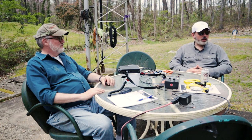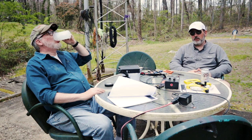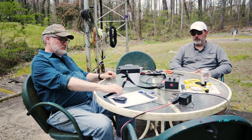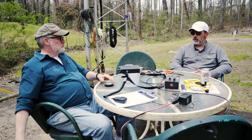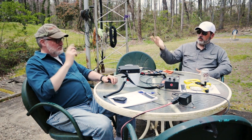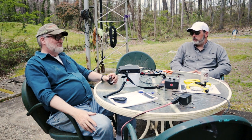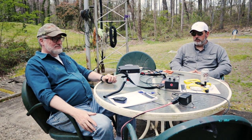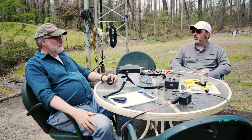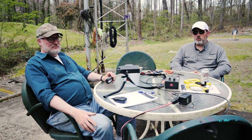And you mentioned Field Day. If you're going out by yourself and there are just a couple of guys, if you're just going to have one station and you're only going to need one antenna, this is an excellent choice for that event. And you might want to consider that. Even if you're doing a bigger thing, you could build multiples of them. Like I said, if you're going to go buy 500 feet of wire, you could build five of them, depending on how much room you've got. It would be a real good Field Day antenna, or if you're just going camping in the woods for the weekend with your buddies. Lots of opportunities and ways to use it.